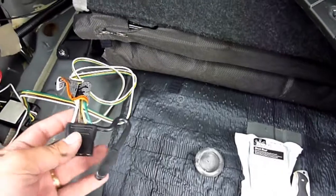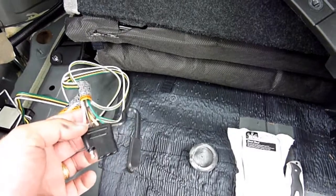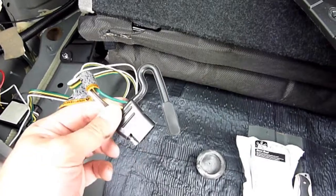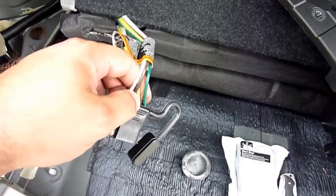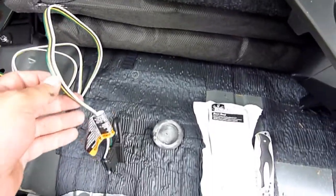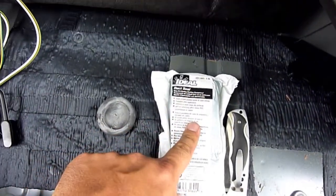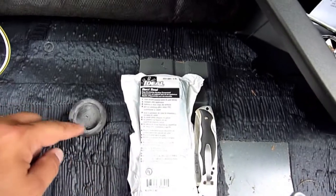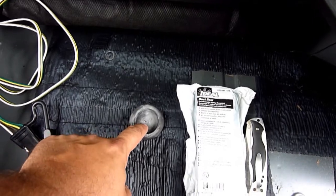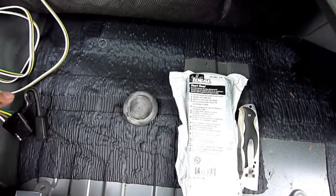It's going to be a little bit difficult. This particular plug end is not the kind that's separate — it's actually built onto it right here. I may have to cut that off and get a more elasticized cover, but I'm going to try and fit it through that grommet with just a slice. I'm not going to cut the hole out — just enough of a slice that the cord will go through, then I'll use some duck seal to fill that in so it still doesn't let air in and has the sound deadening properties.